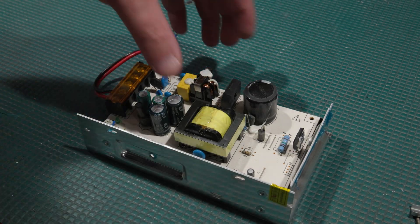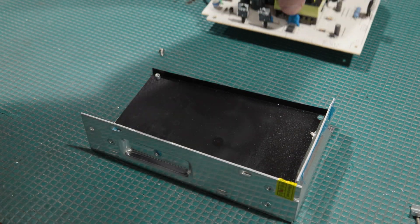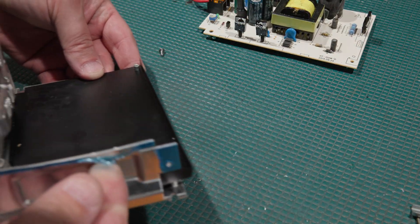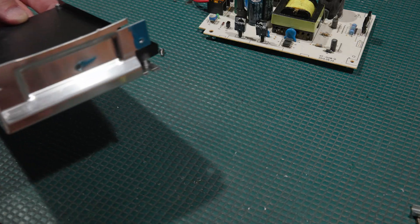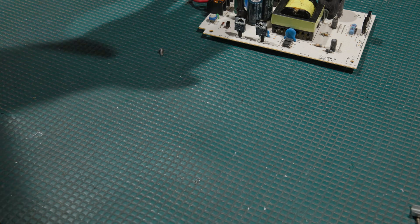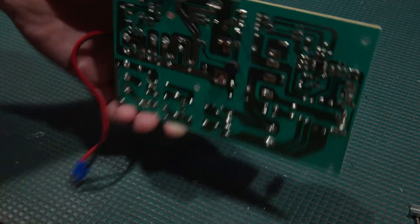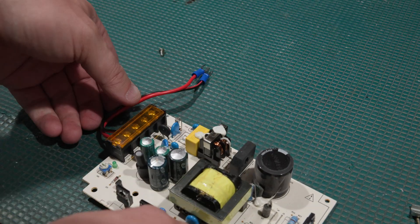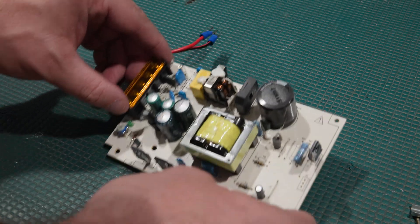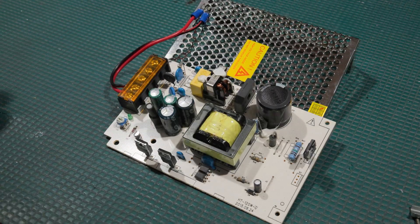I've got the actives taken apart and the whole thing slides out. Nothing like insulation where you'd want a grounded chassis, right? There's the bottom side — not too terrible. A little bit of isolation slots; that's the input filters. This is actually a really good example of simple switch mode power supply design.